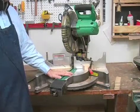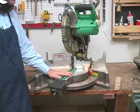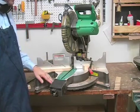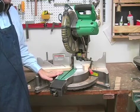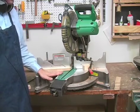While the epoxy is setting up, I want to take a slight detour and talk about block rims. There are some techniques for the expanding jaw chuck that are unique to block rims. The setup for cutting block rim segments is fairly straightforward. I have a miter saw set to 22.5 degrees, and I have a stop. This is going to yield 8 pieces for each layer of my block rim.